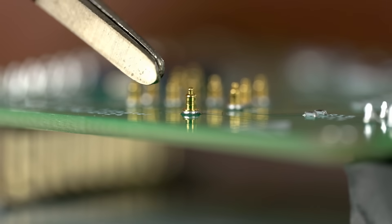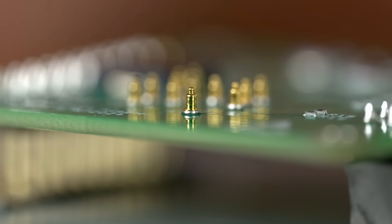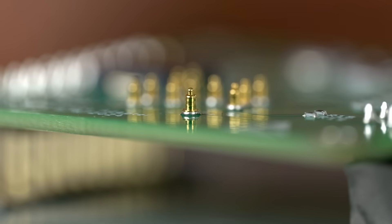The pogo pins at the heart of this fixture are amazing little electrical contacts that I believe are often overlooked. Much like the pogo stick they're named after — that one-legged vehicle that many of us injured ourselves on as kids — pogo pins have a central plunger that is pushed out from the body by a spring. Pogo pins maintain electrical connectivity between the plunger and the body throughout their entire stroke, making them great at providing electrical contact between two objects whose spacing might vary. The end of the plunger is typically a hemisphere, and it can contact pretty much any surface, a pad on a PCB for instance.